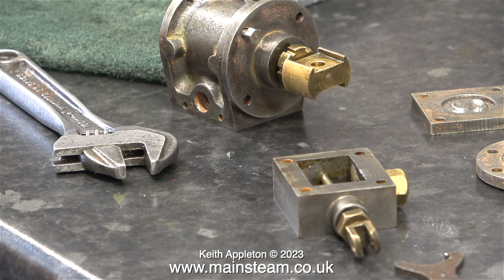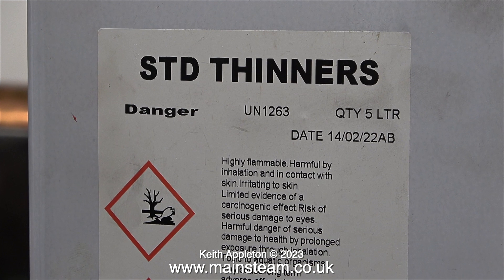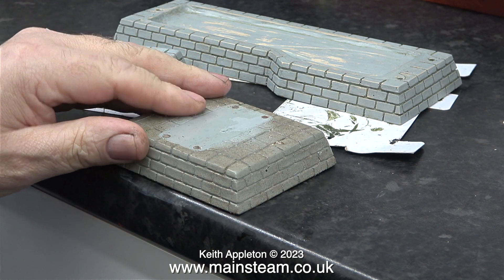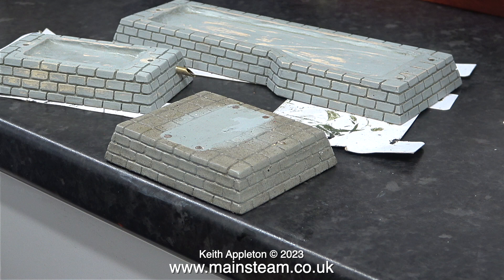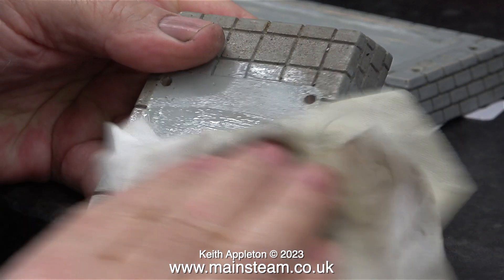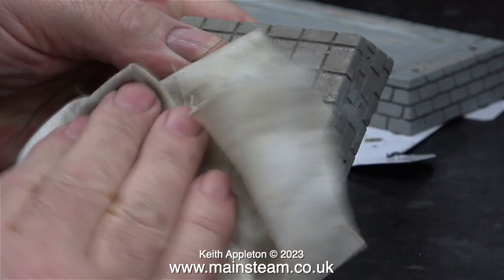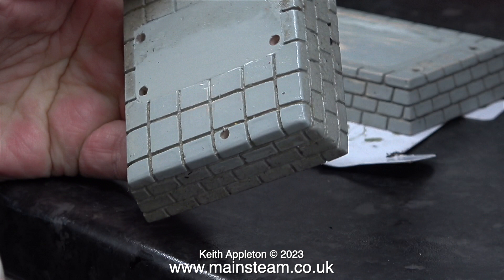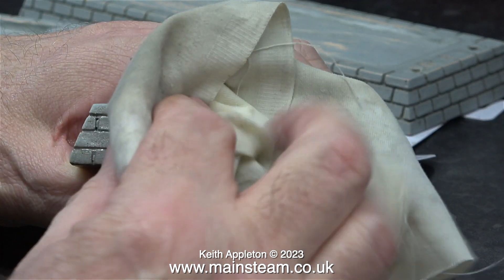Progress has been made in this episode. The cylinder is now ready to bolt back onto the top of the standard, but some of the parts need painting before I do this. Here is a can of standard cellulose thinners — please read what it says on the tin, and please note I am doing this wrong. You're not supposed to handle cellulose thinners without PPE; you need to use it in a very well ventilated area and should really wear rubber gloves. I'm using a cloth with cellulose thinners applied to it — this is very bad practice. The only good thing I can say is it wipes the oil from my hands and also cleans the plinth. One more time: a health and safety warning — keep yourself away from cellulose thinners at all times.